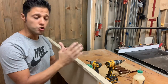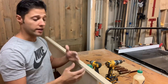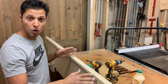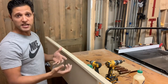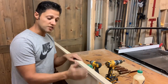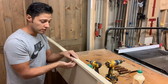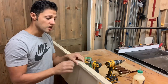I'm working on a built-in unit that has a very large upper carcass with a very long shelf. Normally what I would recommend — and I did recommend to the client — was that the shelves be housed in the face frame so they can be supported by it, since they're pretty long. These shelves are 55 and one eighth inches long. This unit also has to hold a TV, and that's why it's that size. I solid edge banded it and put a groove like I did in the other curio video. Since these shelves are longer, I not only edge banded with a rabbet underneath for support and rigidity, but I also put screws in about every six to eight inches. But I need to plug these holes.